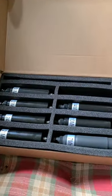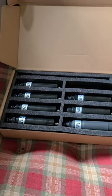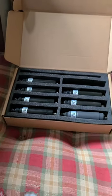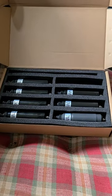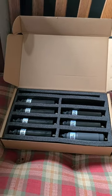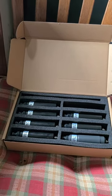I've tested all these coils, each one standing in the yard for SWR on the SWR sweep meter in the radio. Every coil with the whip fully extended and this one length of counterpoise has been 1.5 or under.